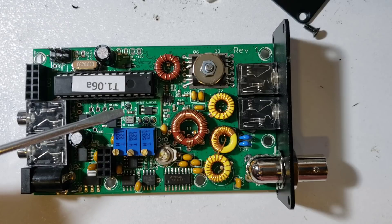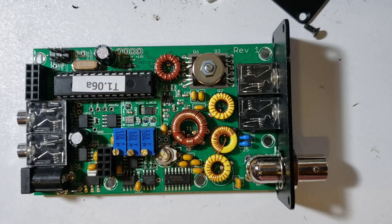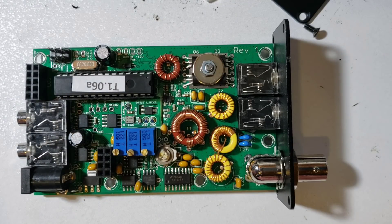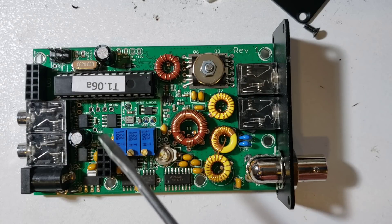If you don't want the TCXO option, there's a 27MHz crystal supplied which just fits in place of that small PCB. Here is the infamous T1 bandpass filter and phase-splitting transformer, and the trimmer capacitor for the bandpass filter. The four quadrature sampling detector capacitors are actually through-hole capacitors — the reason is microphony. SMD components suffer somewhat from that, and it was found that certain crucial capacitors ought to be through-hole types. All the op-amps, resistors, and capacitors are SMD apart from those few critical ones.